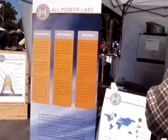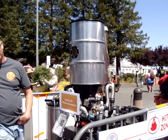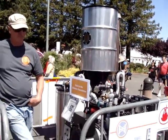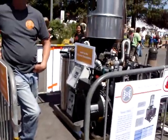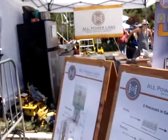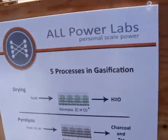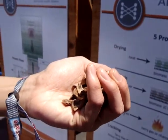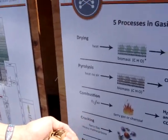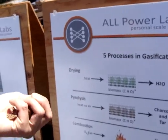Tell me what you have. I'm really interested. Let's take a peek over at the machine real quick. So this thing is the power pallet. It's a biomass genset. And the thing is running off of wood chips — in this case, we're running off of walnut shells. And so the machine basically uses these chemical processes over here. What it's doing is it's converting this — this is a carbohydrate, it's basically cellulose — and it's converting cellulose into hydrogen and carbon monoxide. And since those two gases burn in an engine, we can feed that into an engine and generate electricity.